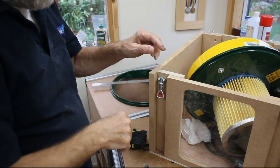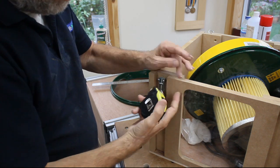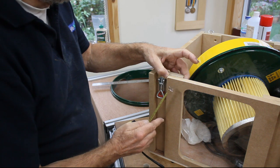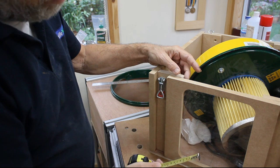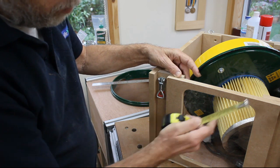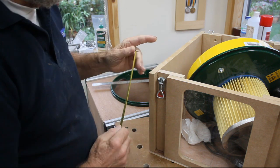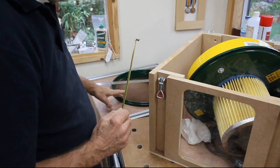I've hit the first problem: because I made that front panel with a fairly thin top rail, there's not an easy way to just take 25mm off the height. I could take the panel off — it is glued on — but that would mean making a complete new front panel. I could take maybe 5mm off the top and 10mm off the bottom and get away with it, but it's a poor solution. So that doesn't leave me much option.